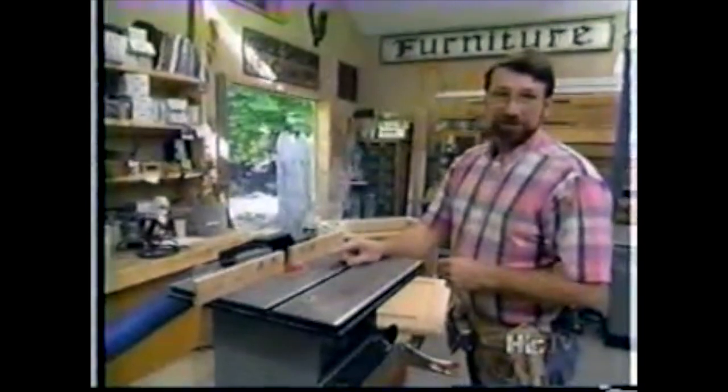The hinges that I'm using on my doors require a 3/8 by 3/8 rabbet. To make that rabbet, I've set up the rabbeting bit in my router table, and I'll run 3 edges of each door.